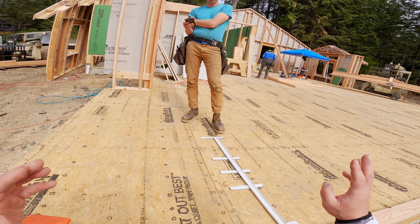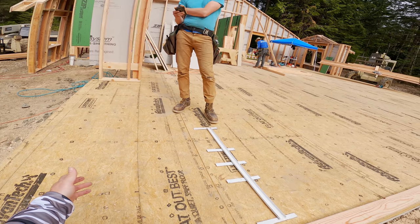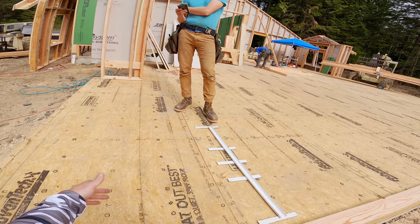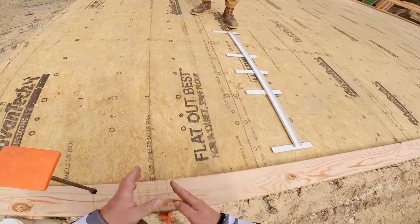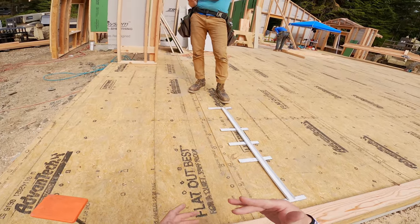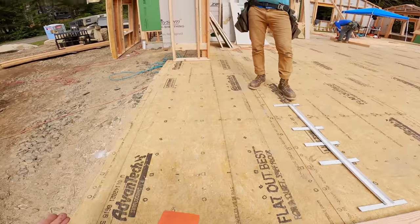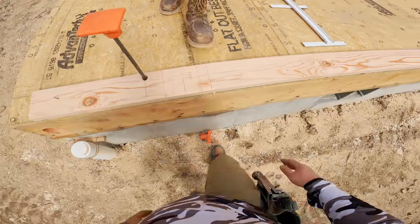And then your top plates also, instead of 42 foot 1/2, they would be minus 11 divided by 2. Okay. You know what I mean? Yeah. And that way they come right to the edge, we can square it. Right. Then this is gonna go up, the other wall will cap it, this wall will come in, this wall will cap it. Okay. So this would be a regular stud.